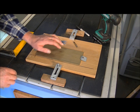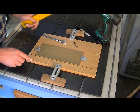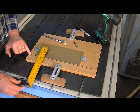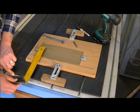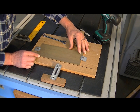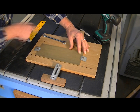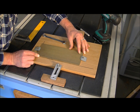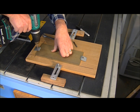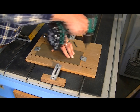Because I'm going to make several of these backing plates, what I've done with a very simple jig — I've clamped this down onto the table, making sure that this datum line here is absolutely parallel with the front edge of the machine, which means everything else is going to be square. I can change and put a new plate on each time. I have an X and a Y line on here so I can line the piece of work up and just clamp it down like that.